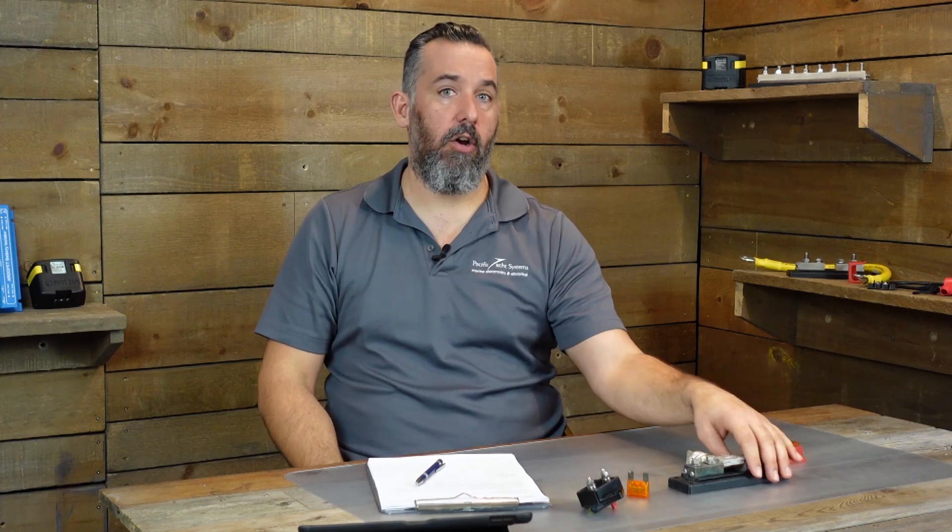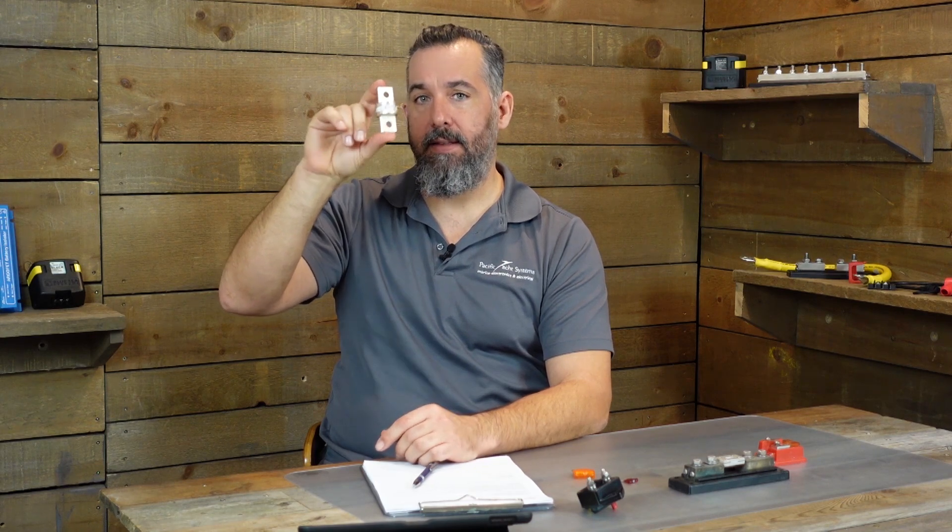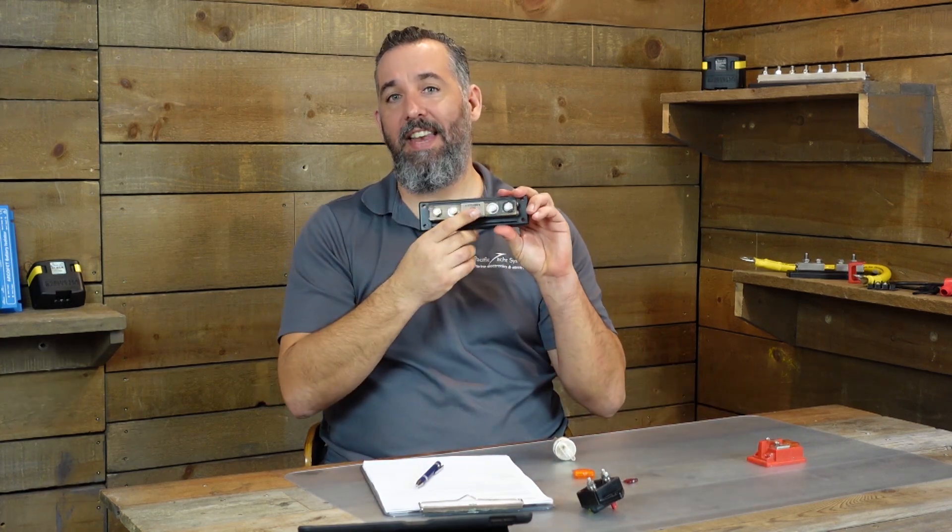The other thing often used are fuses that, when they blow, cannot be reset — they must be swapped. This is called an ATO or ATC fuse — the little fuses we have in our cars. A bigger version is called a maxi fuse — just a bigger blade-style fuse. This here is called a Class T fuse, which we use on inverters a lot — that's what manufacturers recommend. And lastly, this type is called an ANL fuse, which we use on big circuits — bow thrusters are going to have this fuse.